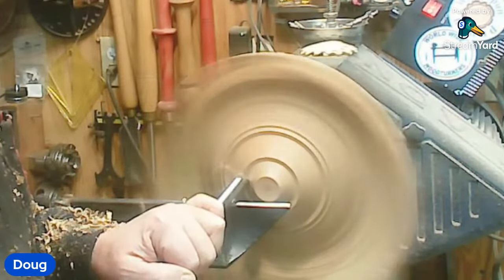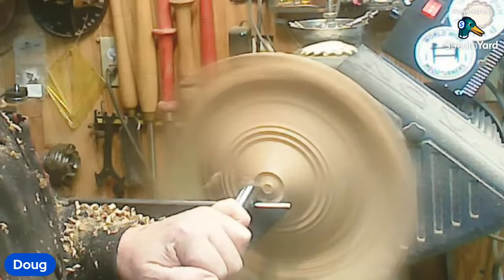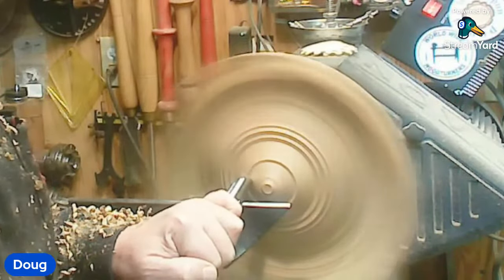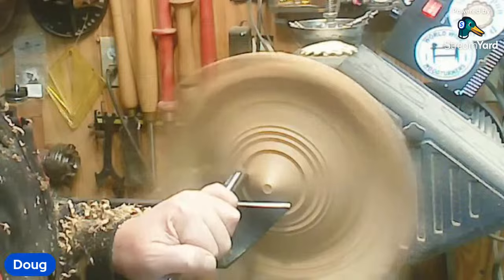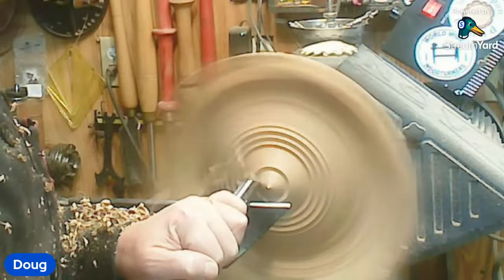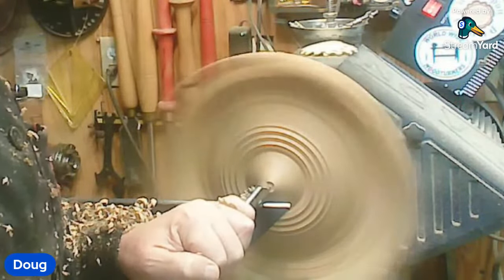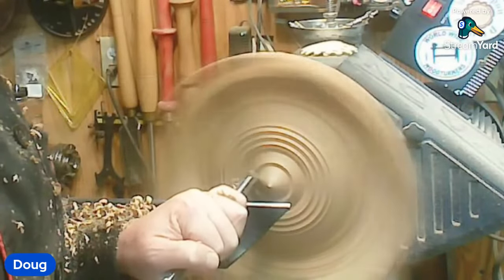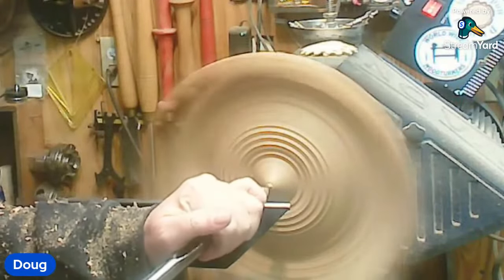Roy said it was a rectangle blank, but not a live edge. Okay. Yeah, the rectangle blank was starting out with a rectangle. If you don't round it out on both ends completely, you can definitely end up with an oval shaped bowl. Same idea as this. But I've seen this on, probably, Discovery Channel from one of the American heritage sites, where you can actually get a lathe that turns oval bowls. Yes, I used one when I was in the Netherlands. And on those, that's exactly what you were talking about. There's a spot where you turn right here, even though it's going up and down. Yeah, you turn exactly on center.